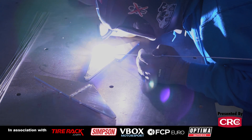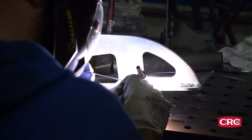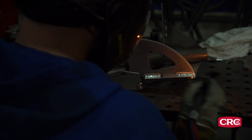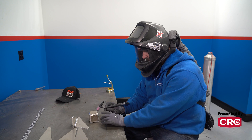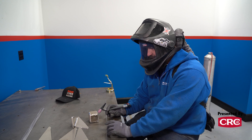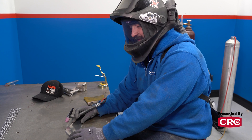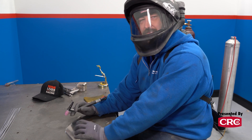I just go fast and control the heat with how fast I actually move. If you move real slow, the heat will grow and get into the part. But if you move really quick, the heat doesn't have enough time to soak into the metal. So I'll weld foot hard down, machine full tilt, and just control how fast I go to walk that puddle right along.